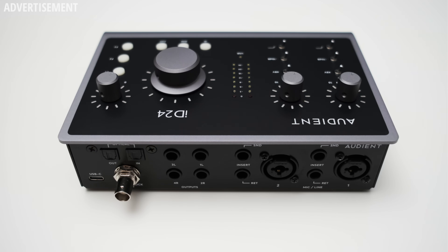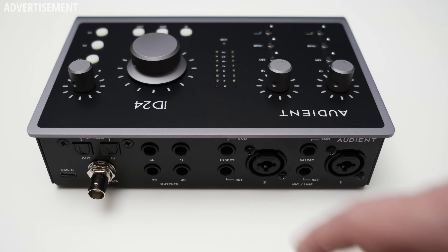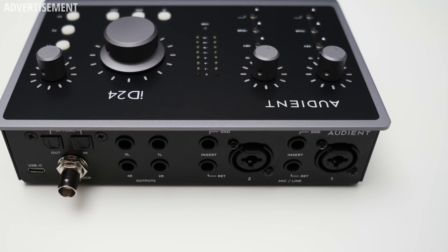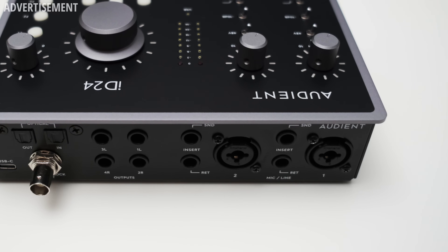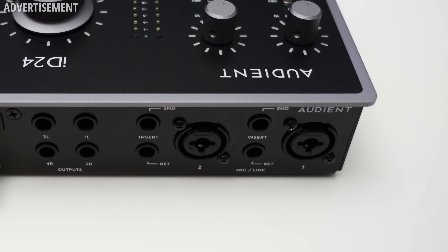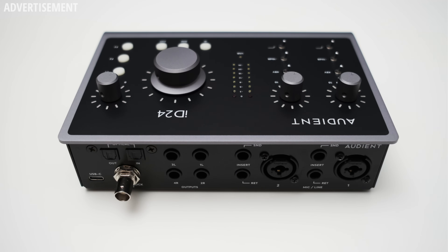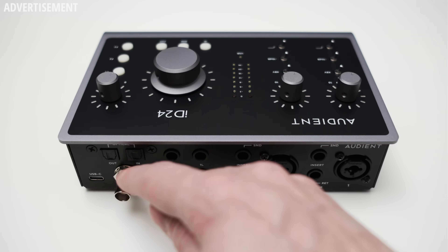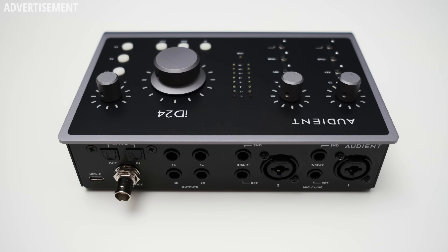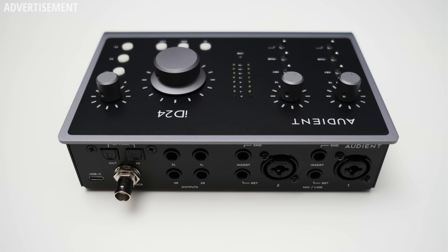If we have a look at the backside you can see quite a bit of IO. You get two XLR and TRS combo inputs that also have inserts — a send and return connection for each channel, allowing you to connect outboard gear after the preamp stage of the ID24 but still before the analog-to-digital conversion, integrating hardware processing directly into the signal flow. The ID24 also offers two sets of balanced TRS outputs so you can connect two sets of monitors and switch between them. You get a word clock output to use the ID24's clock as master to sync additional interfaces — a feature not found on the ID14. For digital IO you get optical in and outputs usable with ADAT or SPDIF, which can expand the channel count even further.